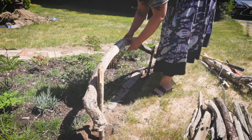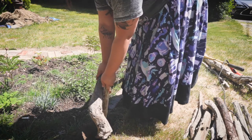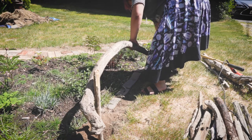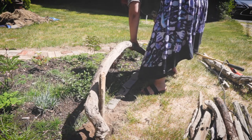One thing I'll note is that I originally used two screws to secure these poles, because I didn't want the fence to wobble. Later, I switched to only one screw at first. After burying, I came back with the drill to add a second screw. This way, I could easily correct the angle of the poles as needed.